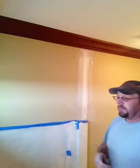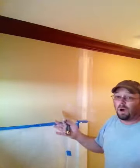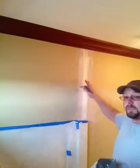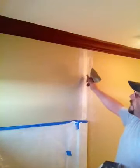Or, you know, some of them don't have concrete piers underneath them. The house moves, especially in Louisiana, swamp around there. House settles and, you know, creates stress right there. So it will crack beside it, but it won't crack here with the tape.